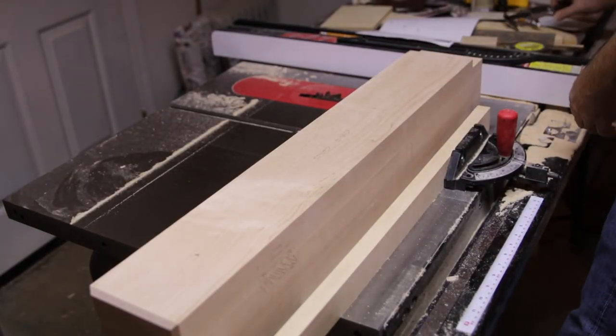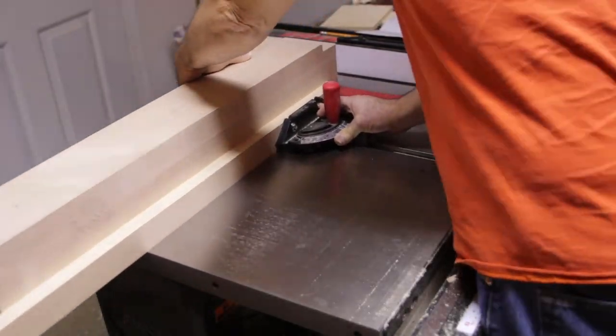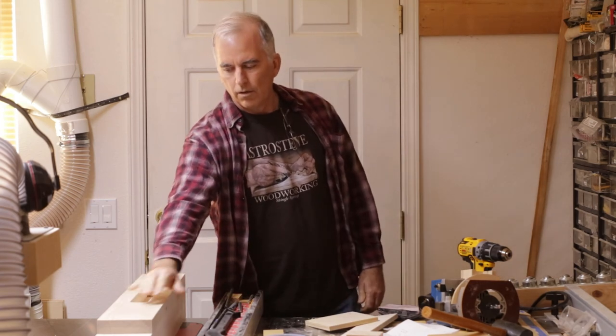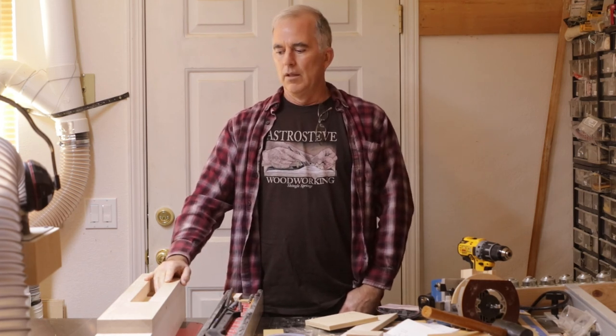There was just a ton of sawdust when I was doing the second pass of the dado cut to its final depth. Since the tenon was already up off the table saw from the first pass, the sawdust just went everywhere - it was a huge mess. Definitely needed a mask there. I should be coming out with another video soon because I already have all the mortises cut in the legs, even the long mortise for the crisscross and my bench vise. I just need to cut the hole for the threaded rod to go through and cut the holes for the dowels to pin the tenons. Then I'm going to be very close to ready to glue up the base of the workbench, which is pretty exciting. Well, that's it for today - please like and subscribe, and I should have another video soon. Thanks.